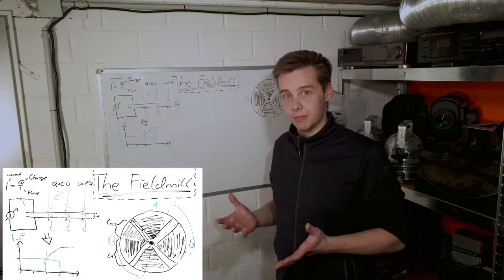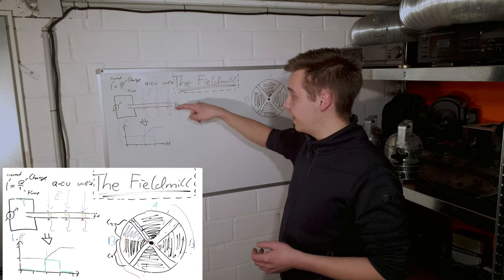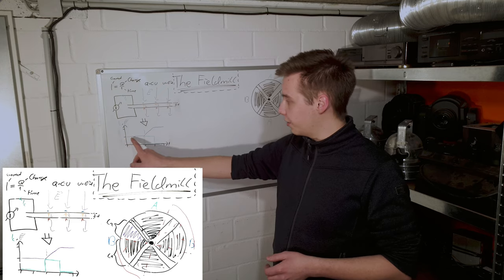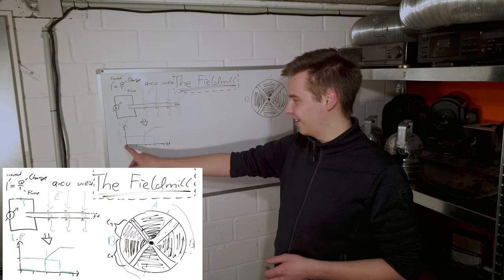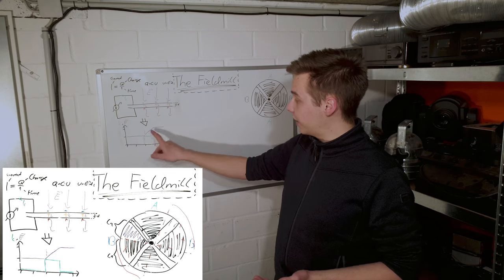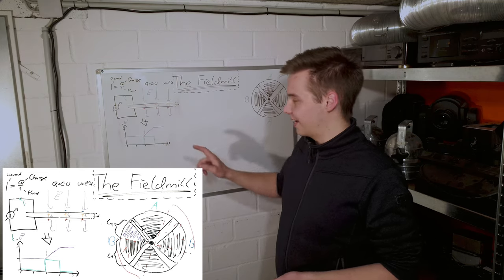And that gives us an estimation to the changing electric field, because as soon as the field is applied and the charges have equalized, there's not going to be any more current flowing. So if we just look at the output curve with a non-changing field, the output current is zero. Just imagine it's zero. I know it's not, but I couldn't really draw it directly on the axis. So again, field doesn't change, output current is zero, field changes, output current is something other than zero, and then it drops to zero again as the field stops changing.